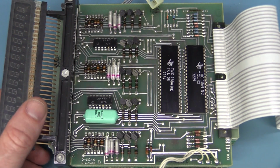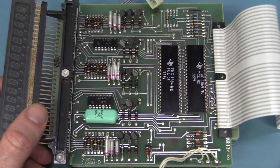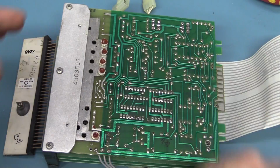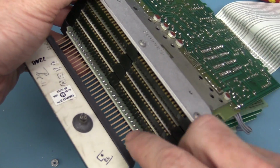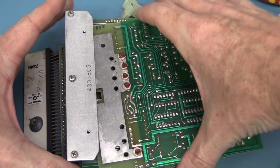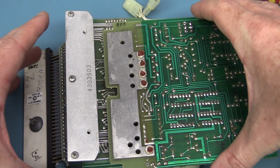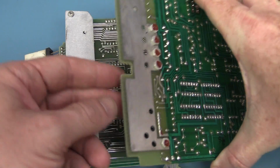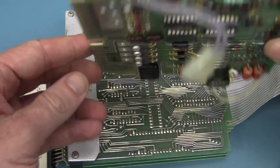Yeah, it takes all the shine off it when all the logic's inside a couple of custom LSIs you'll never get the data on. And they've obviously got a compression fit on these card edge connectors over here, because they wouldn't budge until I loosened all that. And there we go, they all come apart. Obviously they're using all the contacts in there to get power through.